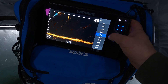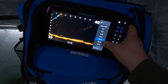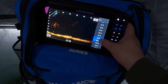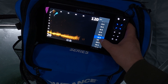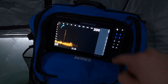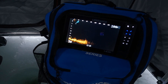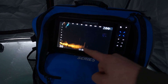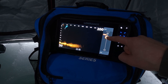Now let's try that on the Lowrance. We're at a 20-foot depth range — Lowrance doesn't give me that increment and I can't do a custom setting, so I'll leave it at 20. Forward range is at 40, so now we're going out: 60, 80, 100, 120, 150, 200 feet. Clearing the screen so we have a full screen like we did on the Garmin. At a 200-foot range we have usable maybe 100 to 120 feet — so we have about 50 extra feet on the Garmin over the Lowrance.